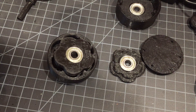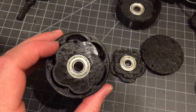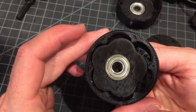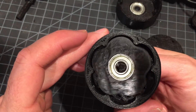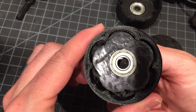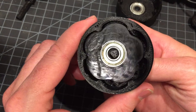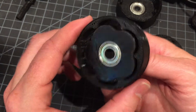This is a video of the two-stage hypocycloidal gear that I designed and made using the script from Alex. The first one I built was just a single stage, just to test it out and make sure it works. This is a five-to-one gear ratio hypocycloidal. The problem with a single stage is that the output is eccentric, so you need to have a special adapter in order to take this eccentric output and make it coaxial with the input.